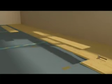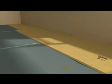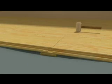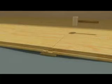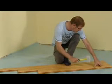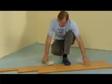6. If two panels are not in the same level, please put a piece of 2 mm plywood under the joint area, or spade the concrete floor to be smooth. While tapping the short edge joint area, we strongly recommend that you use your hand or finger to press the exposed edges of the positioned panels, so that the panels are in full touch with the ground. If the underfloor is extremely uneven, first use a finger to press the low hook of panel 2, then tap the joint area.